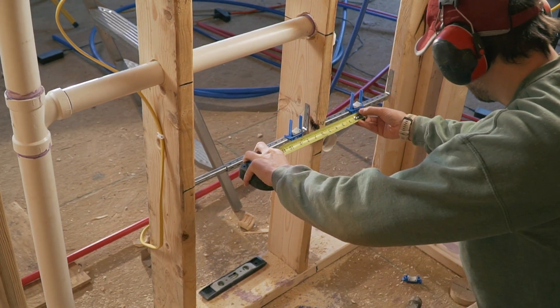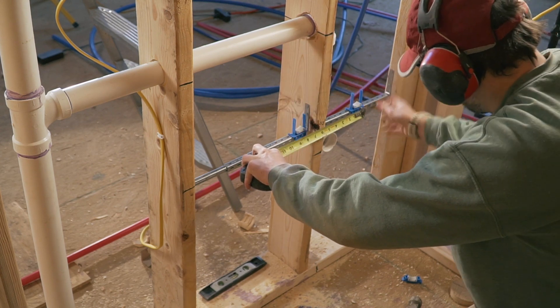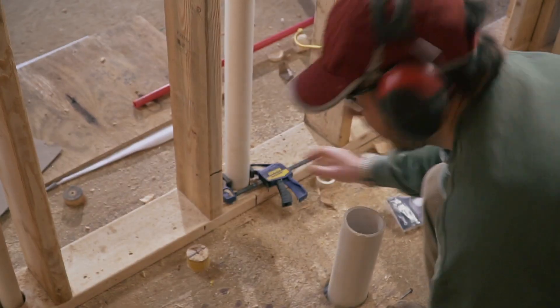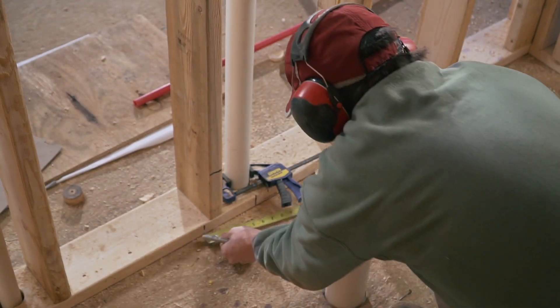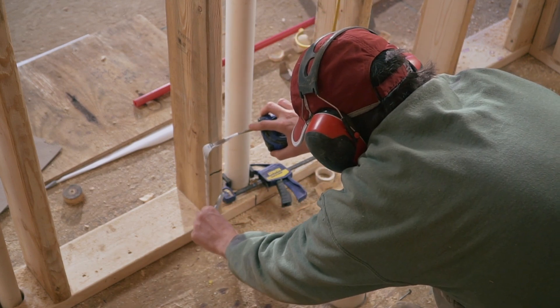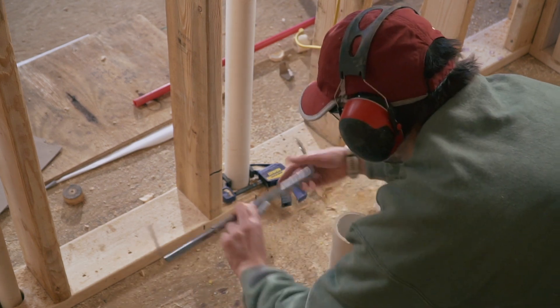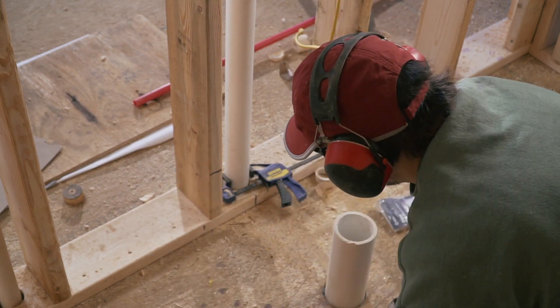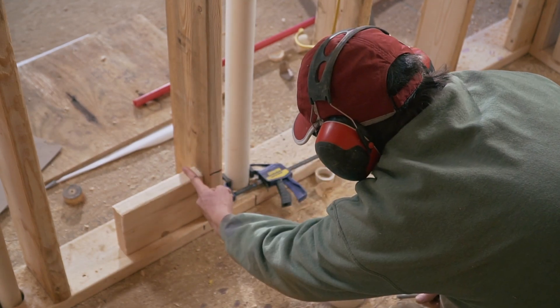Typically we want this four inches on each side. Next one is the toilet, and the toilet is going to have to be on the left side. It has to be six inches on the left and then seven and a half from the bottom, because it's seven from the finish floor — so seven and a half from the subfloor. Instead of wasting another one of these because they're expensive, I'm just going to put a piece of two-by-six and then it's going to lay right here.